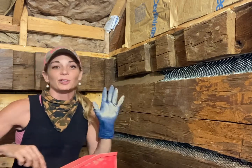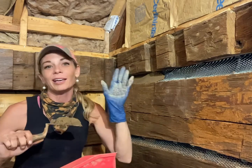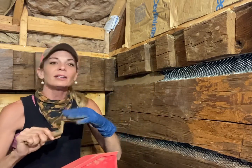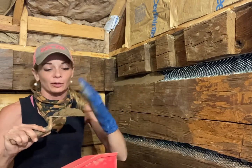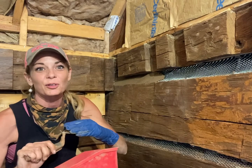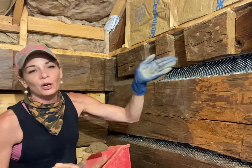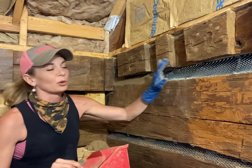And then you'll see a lot of people that use two trowels and it looks awesome, like they're hibachi chefs. They'll pack it on, and instead of using their hand like I do as a trowel, they've got their second trowel and they can put it up that way. Doesn't really matter how you do it, as long as you're using something to pack it, whether it's your hand or another trowel. And this is a particularly weird log since it goes in and out, but it's the same process whether it's a normal log or one that indents.